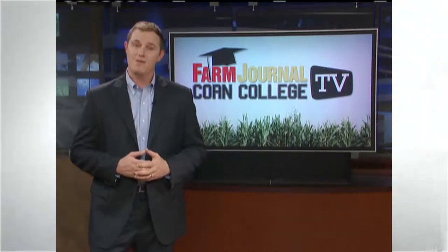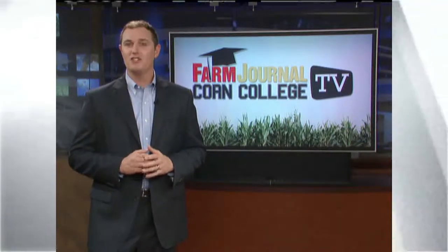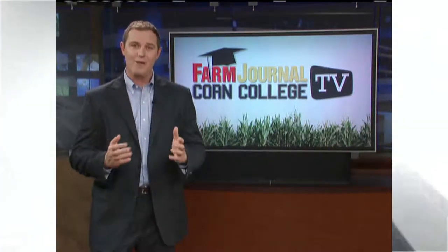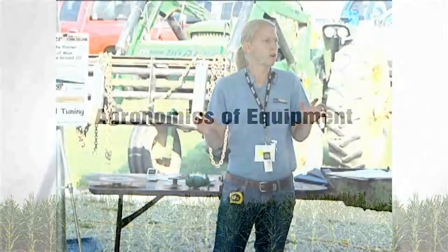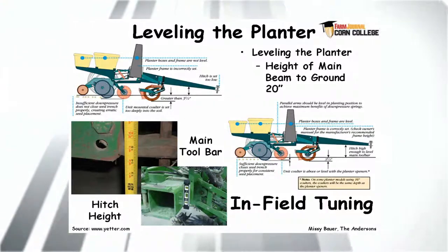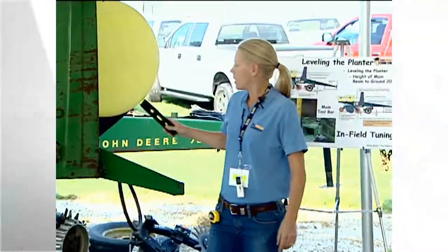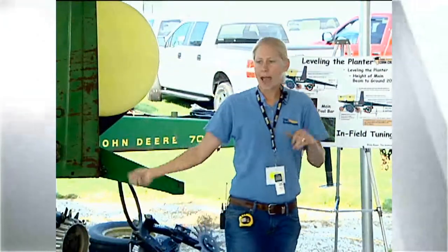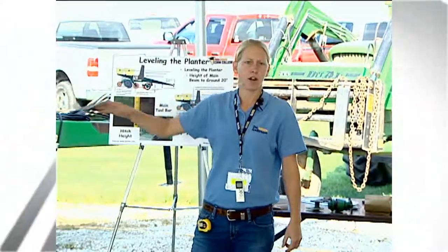Planters come in a lot of shapes and sizes, but no matter the make, there's one thing they have in common - the purpose of setting seeds. Now she's back with today's Agronomics of Equipment to look at some planter basics. We start with getting things level. This is probably one of the most critical things or mistakes we see made in the field. Even though most of what I'm talking about is stuff we're going to do in the shop, I really want to emphasize about this leveling the planter, because so many things can change if this planter is not leveled. When you're out in the field and going to set your planter up, what I suggest is just having a little magnetic level, set it right down on the main tool bar, and as somebody is in the tractor driving, you're going to be walking along the side watching that level there and making sure that we're staying in the bubble.